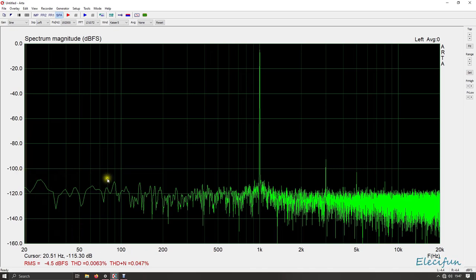which is a much better result than what I got before, when the noise floor I had was more like 105. So all this noise here would be sat up here, and I could only read off what was off the top, which meant that with the noise and everything else, it was giving me an order of magnitude less. In actual fact, an order of magnitude less, because we were more like 0.05 here or 6. So this is a much better way of doing this. Of course, I can't run the other test, the frequency noise, with this bit of software, but it makes no difference. This just gives a little bit of extra insight into seeing that.